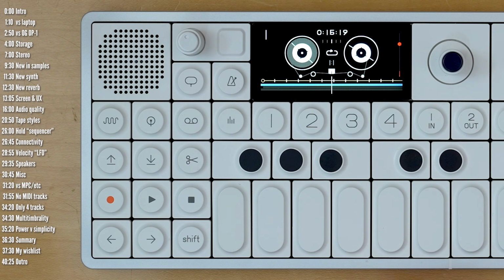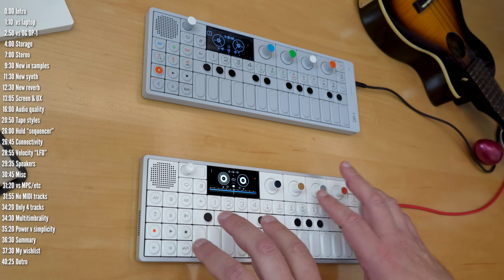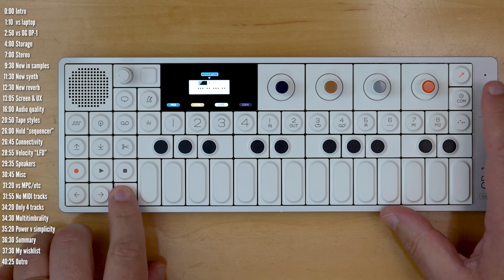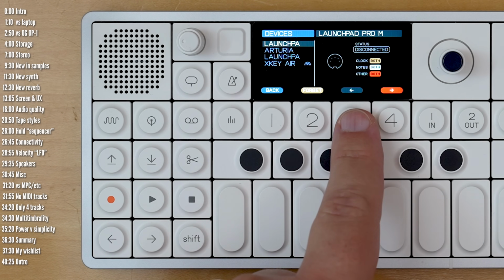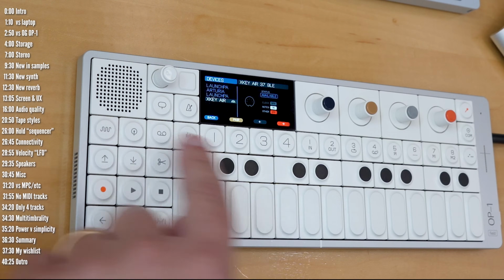While we're on the topic of the recording options, both have an FM radio option, but the OP-1 Field also has an FM transmitter. And then the last advantage OP-1 Field has over the original OP-1 is Bluetooth for MIDI, though. You can't broadcast audio over Bluetooth, and you can't send audio to it over Bluetooth, at least not in this firmware. You access Bluetooth in the comm settings, then go ahead and advertise the fact that you've got Bluetooth, and go to the list of Bluetooth devices and hit pair.